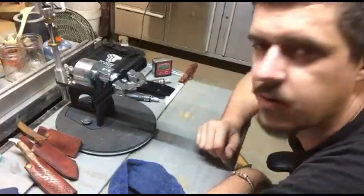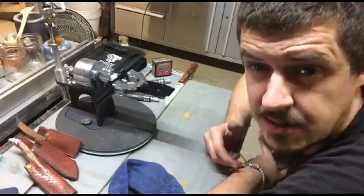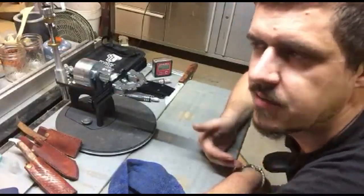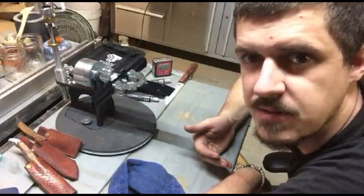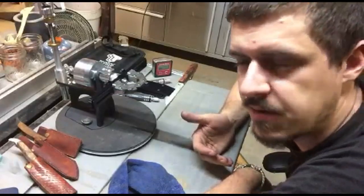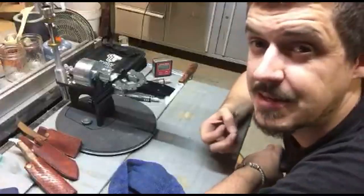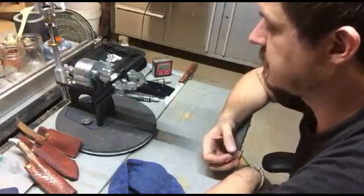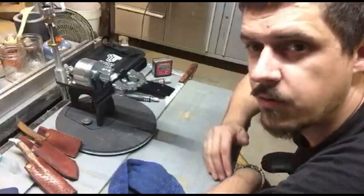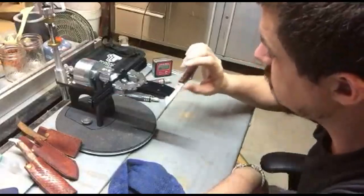So when I'm making this, it's designed for utilitarian use, so I want a nice thick hefty blade because it's never going to be used for fine detail carving or shaving or anything like that. The person that's going to use it is not, that I know of, particularly savvy with sharpening knives, so having a nice thick wide blade bevel on it will allow it to function very well for opening boxes and packets and things like that, but at the same time maintain incredible edge strength under that duress. It'll never have the fine cutting power of something with a 15-degree angle or a 12-degree angle, but it will function very, very well and effectively for general purpose stuff.